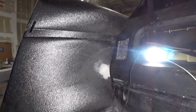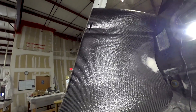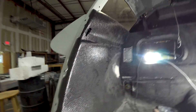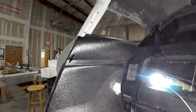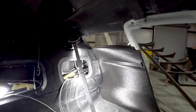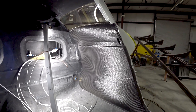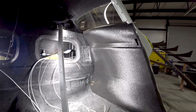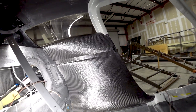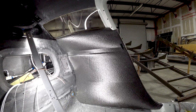And there's one of the ones for the rear — behind the seat. You can see I slotted it out for where the little bracket is that has the gas strut that holds the door open. That's the one that had a little patch on there because it had a little blemish from when it was laid up, but it's fitting really nicely around there — it's going to look good with the vinyl on it. And there's the one on the other side. It didn't take me too long to get those all sorted out — just had to trim around the edges to make it fit nicely, because it all comes with flanges when it's laid up.